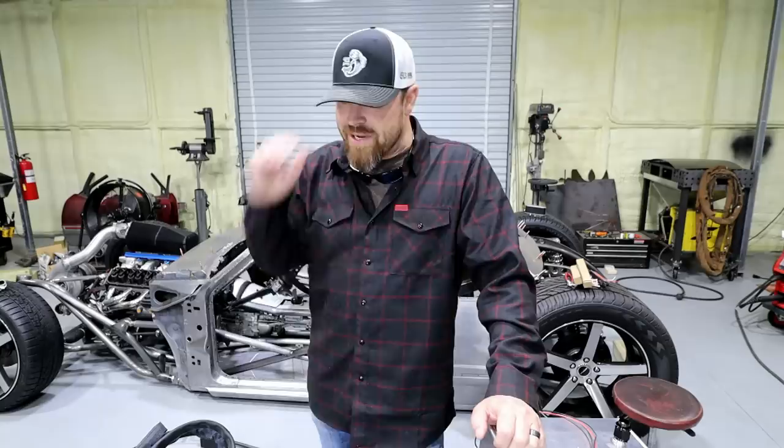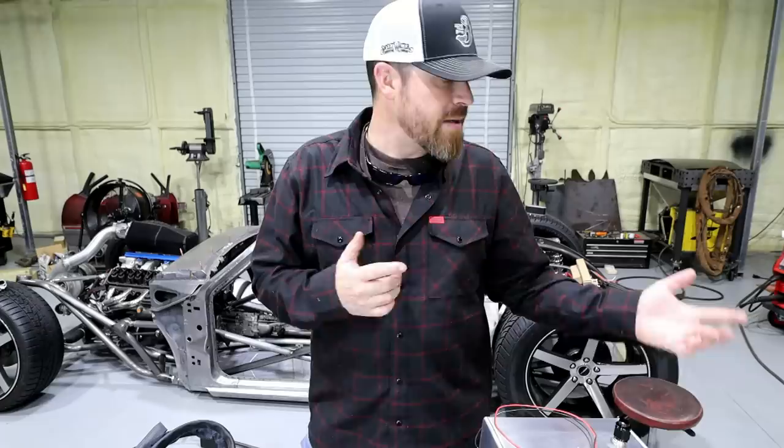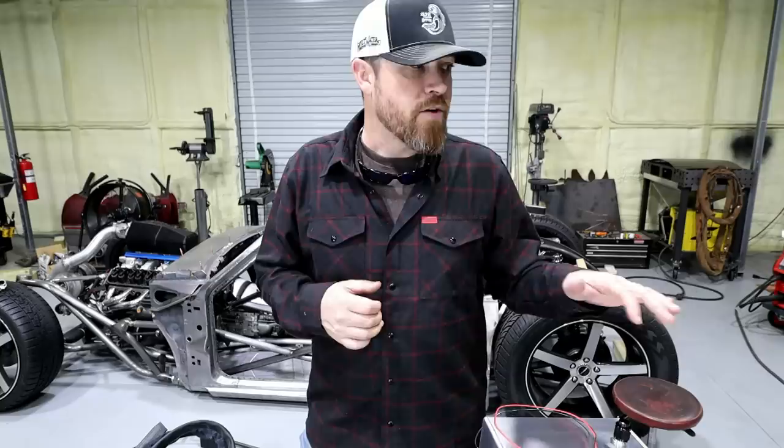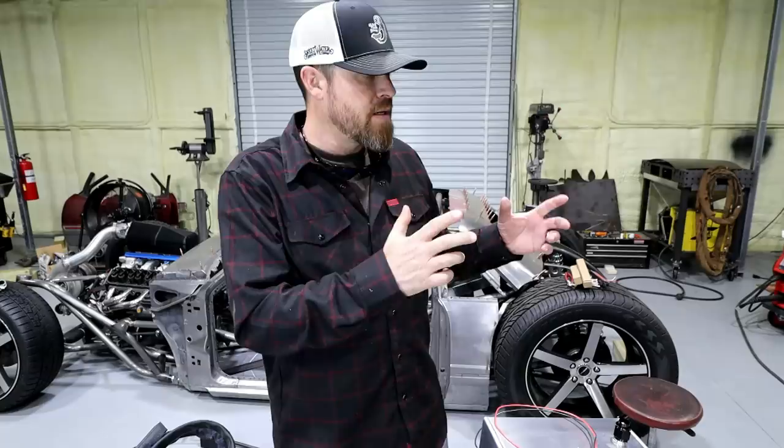The reason I like this is you can spend a little extra money, upgrade your torch head to a smaller size if that's what you're into, and get that 25-foot length. And then for a little bit extra, you can extend your ground lead. If you go with a 1-aught cable, it's like under $3 a foot. You can get a length of that and extend both, and then your welder can sit in one spot in your shop and you can stretch that thing around anywhere you need to.